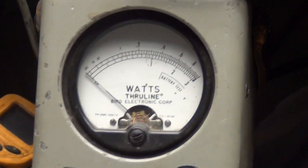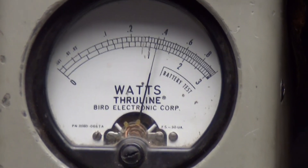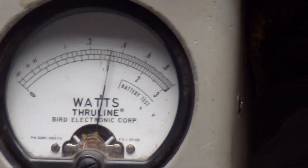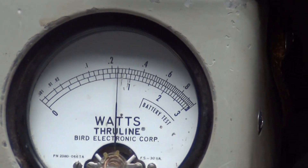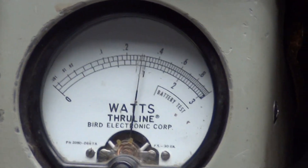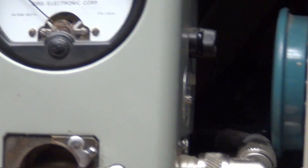Starting the little routine over again. Back to the 10-watt scale, key the mic — we get about 3 watts, a little bit over. I'm going to change that scale to 100. See, those are three still on top at zero, so that'd be three with a zero — thirty watts peak power. Now we're going to take this guy out.